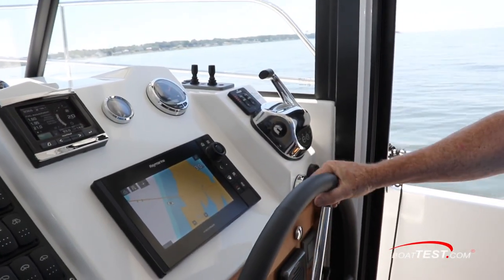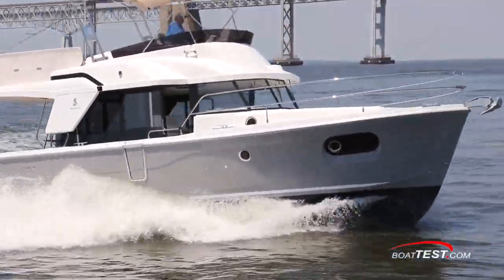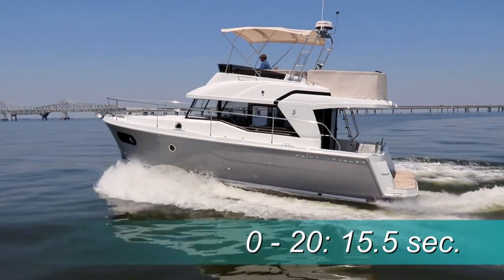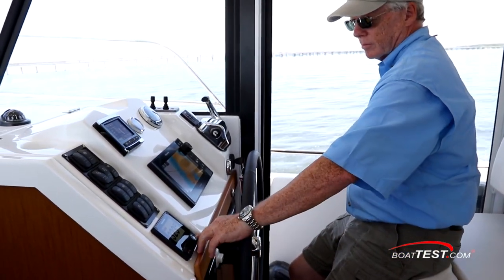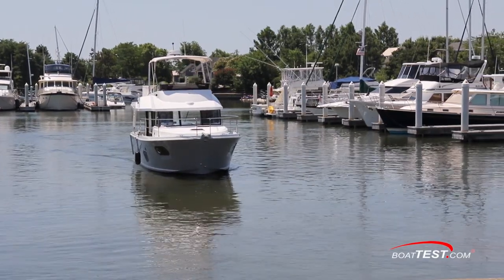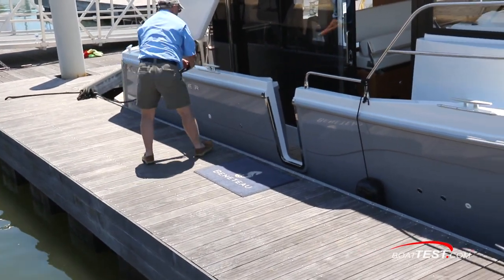With flat conditions, we had no real way to test her handling characteristics fully, but we did find her to be responsive to the helm and steady crossing wakes. No matter how heavy-handed I tried to get, she just wasn't having any of it and remained comfortable throughout. Nothing happened quickly so that everyone would be grabbing for support. She came up on plane in an average 7.3 seconds and continued to 20 mph at 15.5 seconds, almost her top speed. It was also easy to just take your hands off the wheel and let her run — there was no wandering of the heading whatsoever. She's clearly made for long runs and it seems the autopilot is more of a convenience than a necessity. Coming back to the dock, I had another chance to check her docking capabilities, and the convenience of the side doors showed up as I stepped out and tied her up single-handed — a trademark of how well Swifts can be operated with no crew.